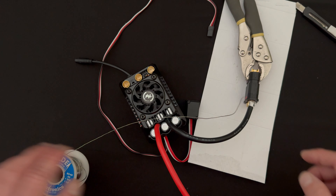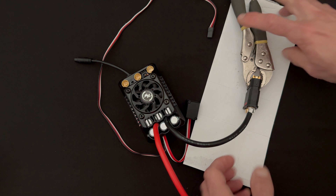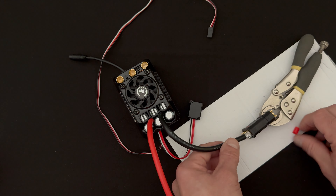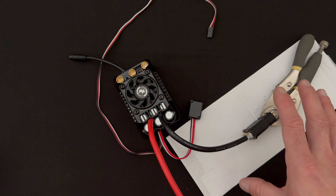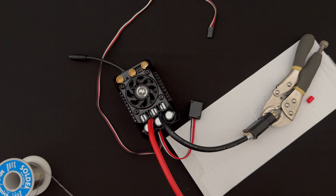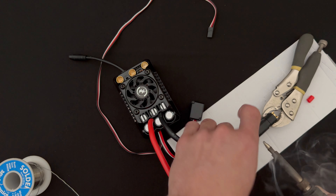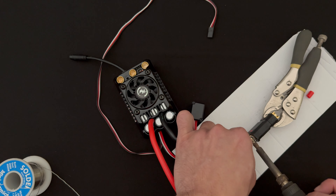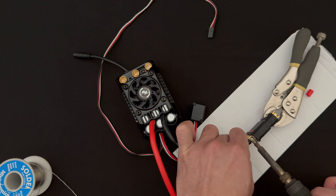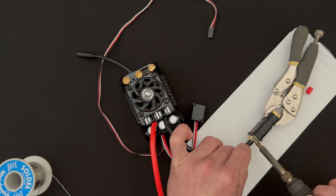I need to let this cool off and let the iron heat back up, because when you're using big wire like this it pulls a lot of heat out of the soldering tip and makes the solder not want to flow. Take a break for a minute or two. This station has a heat lamp indicator that blinks when it thinks it's up to temperature. Hit it with some fresh solder, then lay the wire down while applying downward pressure to get it all the way into the plug.